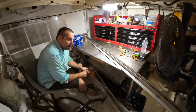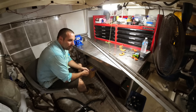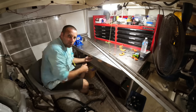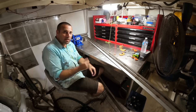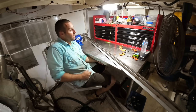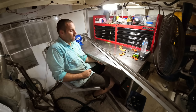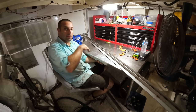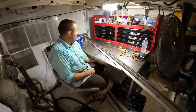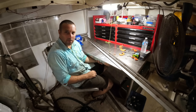Okay, so it's got a slight bow in it. It's got a bow going that way, so I might just try and get it outside, put it vertical on a couple of blocks or something, and just try and literally stand on it. We had exactly the same problem when we made the sliders for the arms for the wings. They had a horrific bow, and we ended up hitting them with a couple of 12-ton jacks and some chains, and that was what it took to straighten those out. Stainless is notorious for bending. I just didn't think this would bend as much as it has, but.